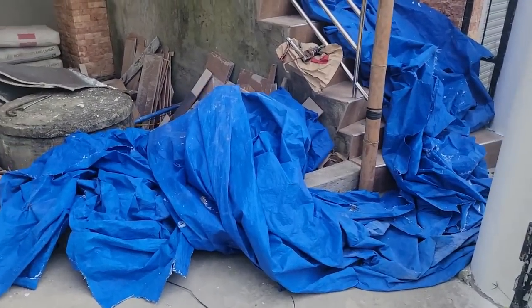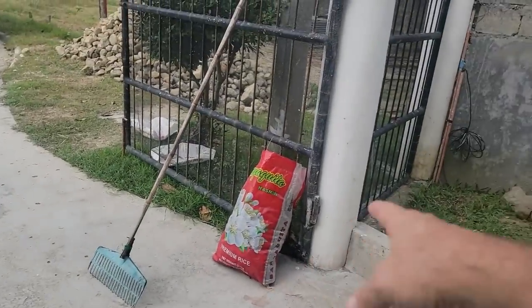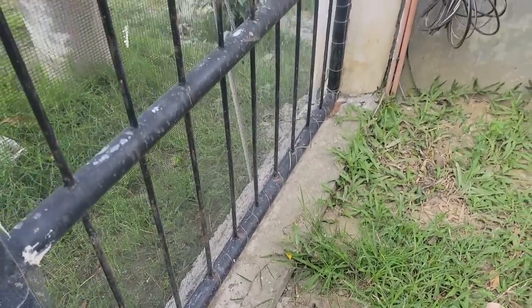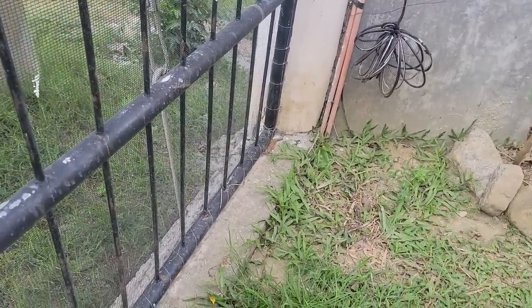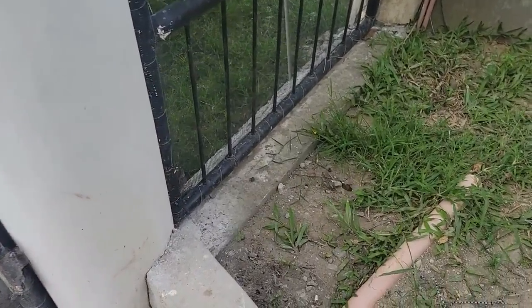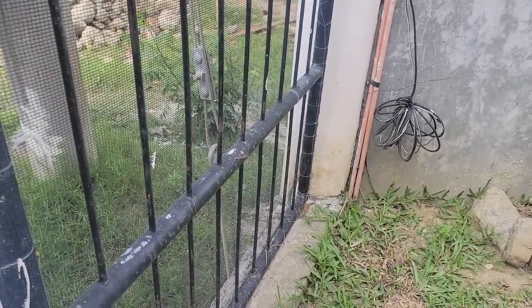And one of the reasons why is starting from that corner column where we built the garage to that column, to this one underneath here, all the way across. And now you can see it right here is a big old beam. You see that beam? So those aren't just columns dug in the ground freestanding with a footing or something on them. Those are columns with a footing and with a tie beam on them, connecting each one of these across as one solid unit all the way across. And it's a big old beam now. So not only does it retain my soil and stuff inside my lot, but you dig down right there, that is a big old beam. And that way we never have to worry about shifting and settling.